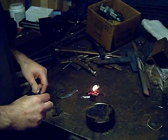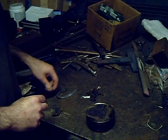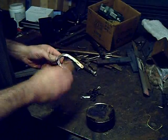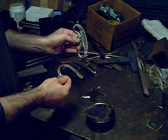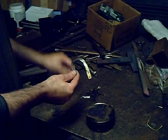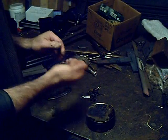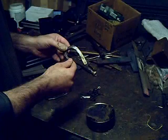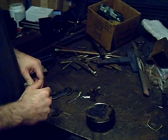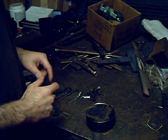Similar versions were used for lighting a pipe or a household cooking fire back in the 1800s. There are lots of different types of strikers — this is just one — but they all have a tool steel edge in common. That's another type I made a long time ago. It's a simple little project using an old file — you can use a flat file, a round one, or a triangular one. It's the tool steel that you're actually after. I've had good success using spring steel for making strikers. W1 works well. The main thing is it has to have a good carbon content.